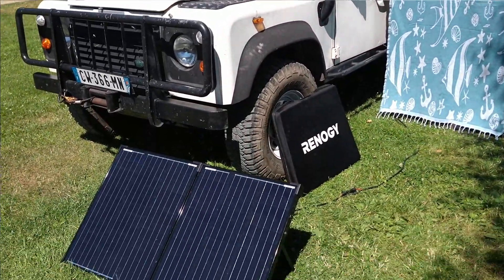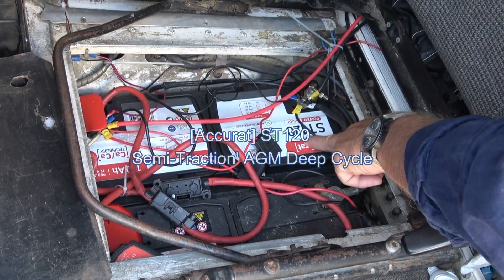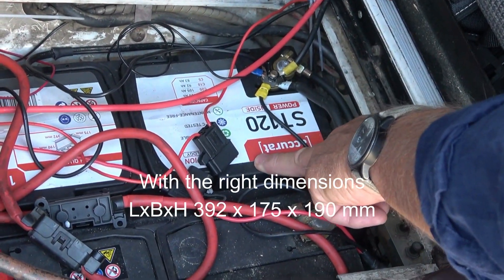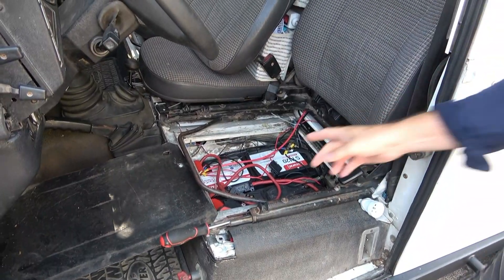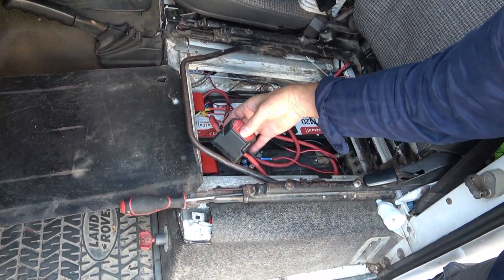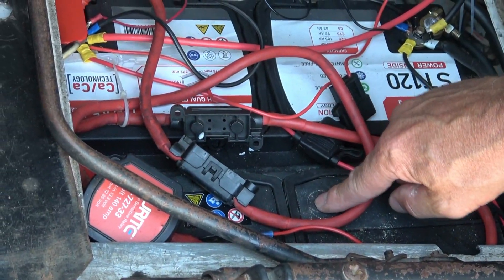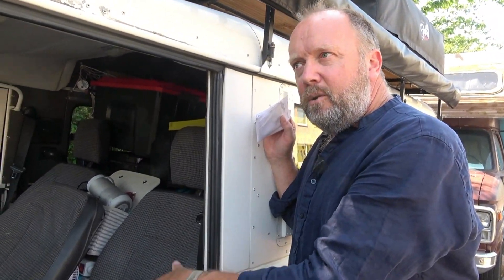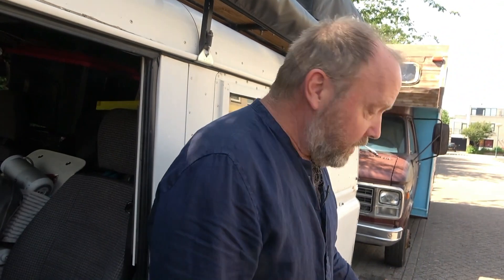It's worked so far — we've been charging for a couple of weeks with no worries. Here's our double battery system: this one is for the car itself, and this is our leisure battery at 120 amp-hours. I'll put a link below — it's the best one so far. The one Achilles heel with a solar panel system is your battery storage; you have to spend a bit of money on batteries too, which I haven't done in the past. The leisure battery is also connected to the main battery by this unit, which charges from the main battery. When your alternator charges the main battery and it's full, it releases like a switch and starts charging the leisure battery as well.